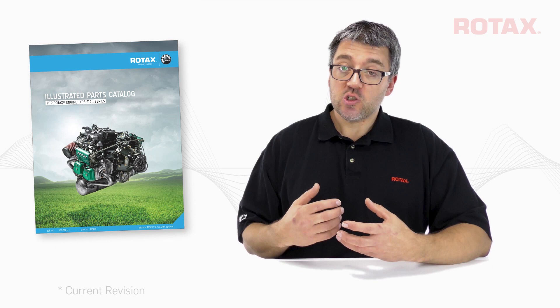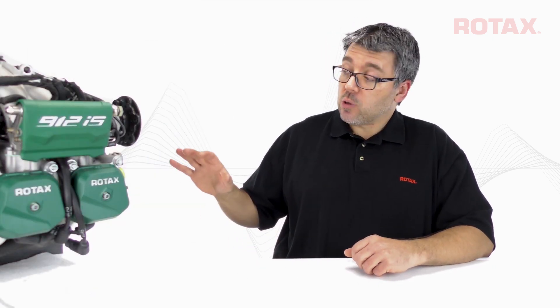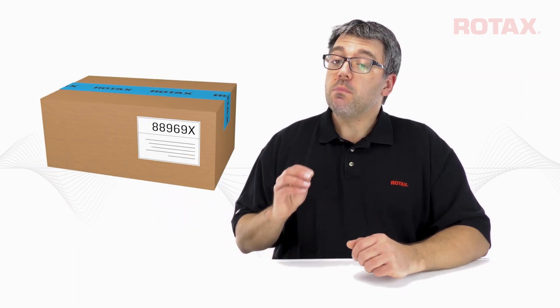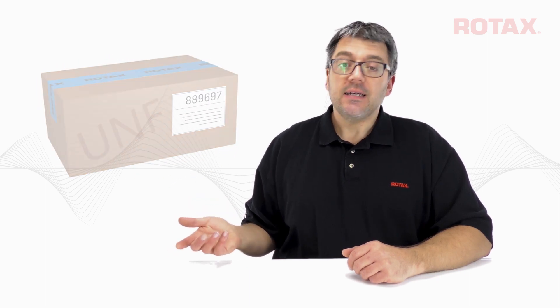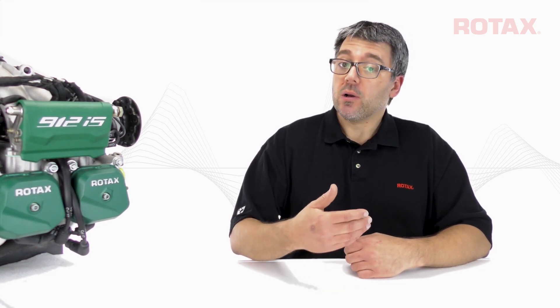As per the respective engine's illustrated parts catalogue, these fuel pump assemblies can be used with both 912iS and 915iS series engines. Keep in mind that when Rotax packages fuel pump assemblies ready for shipment, a new part number is attached. Packaged fuel pump part numbers are 889697 for the UNF assembly and 889699 for the metric assembly. Service documents affect fuel pump assembly or individual fuel pump part number or serial numbers, not packaged part numbers.